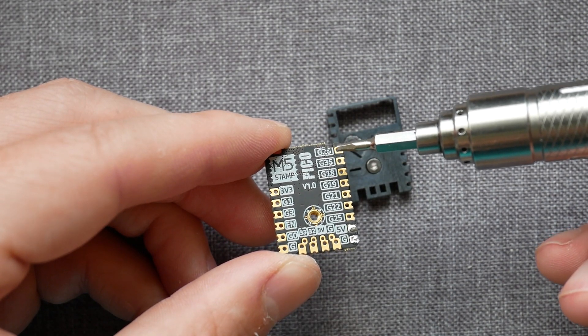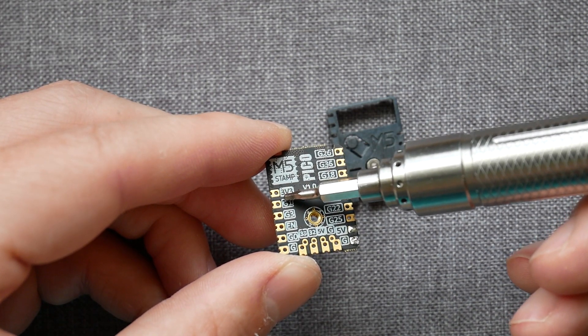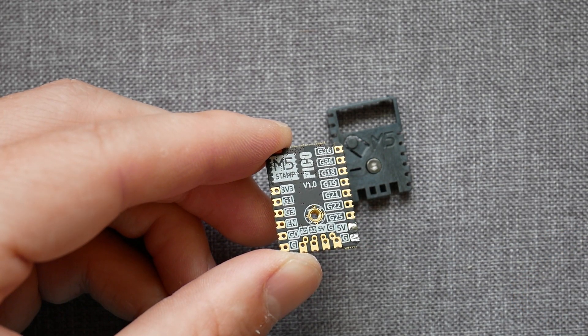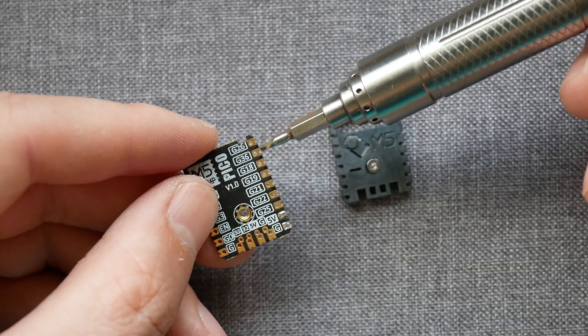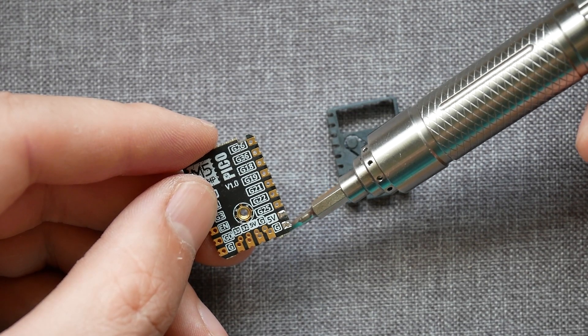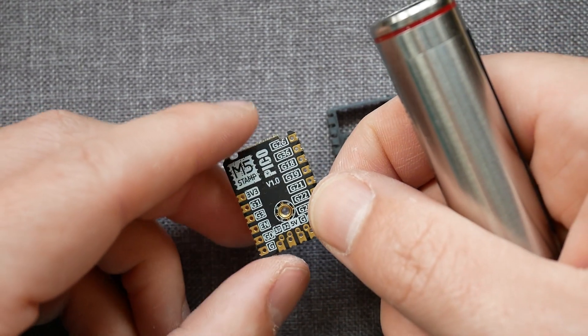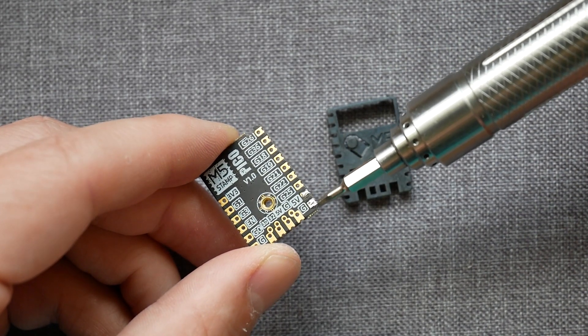On the right edge of the board, we have 6 GPIO pins, and while you can assign them to anything you want, the default function for them is to flash your firmware, because they support FTDI programming. So if you've got your own FTDI programmer, or if you purchased the kit with a programmer, you'll be able to flash additional firmware. This step isn't required because this board comes pre-flashed. On the left-hand side, you've got additional GPIOs which you can use to define your own use cases, including DAC, ADC, or PWM signals.